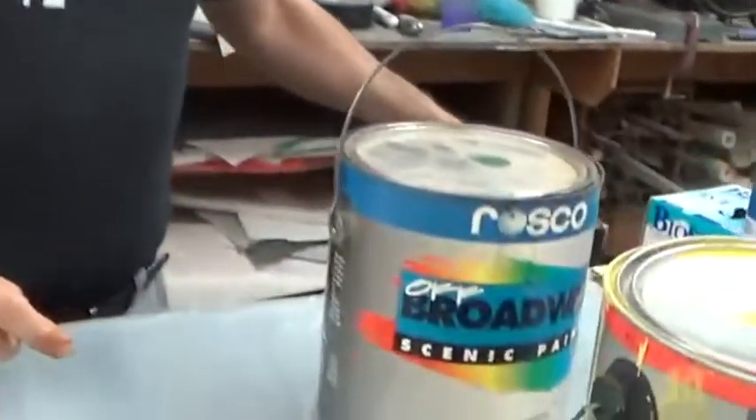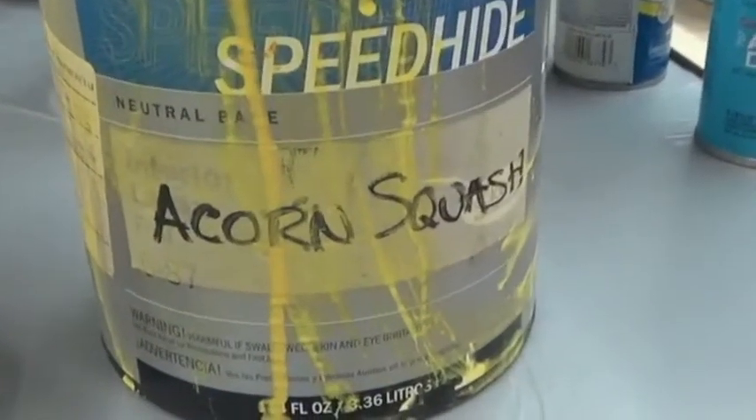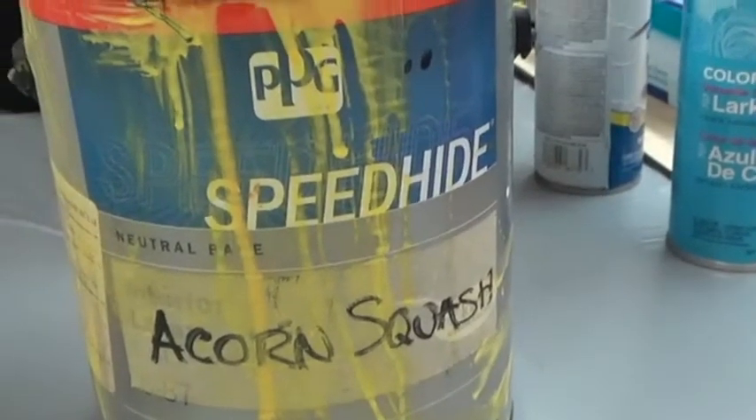As far as types of paint, I normally use standard household paint. It's easy to get, can be mixed in many colors, easy to work with, and it's water soluble. Always remember to look at the label to make sure it's a latex paint and not an oil paint. If you get an oil paint, you're going to notice a really distinct smell and it has kind of an oily feel to it. What it doesn't do is wash out — you have to use a thinner or solvent to get rid of it. So if you open a can and it smells really funny, check the label. If it says oil, stop and make sure that's what you're supposed to be using. There are very few circumstances where that's the case, so don't use it unless you need to.